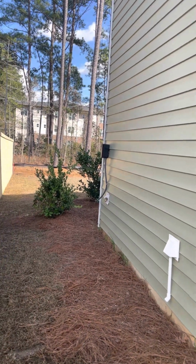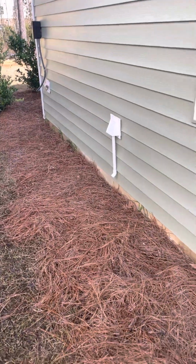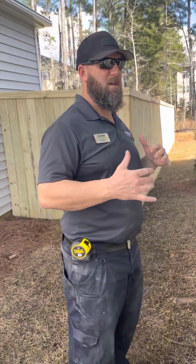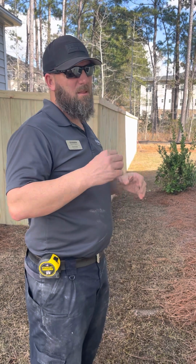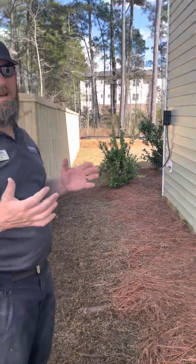So you look right here. This is your primary drain line. Your AC unit is in the attic. AC puts out cold air. It's hot, it sweats. That has to drop into a pan, and that has to drain somewhere. It drains here. This should be dripping 9-10 months out of the year because it's hot down here.